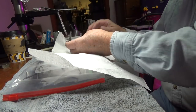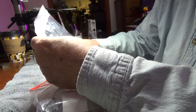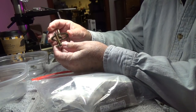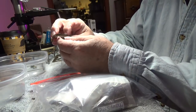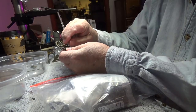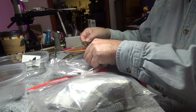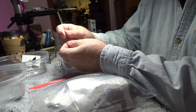Plates. Okay, there's the perch for the cuckoo. This is center wheel. Well, part of the center wheel. This is the minute hand, and this is the hour tube. So that's for time. This is the count wheel that goes on the outside of the movement, and there'll be a little gear that runs this, that goes down near the bottom somewhere. And okay, this is the tension washer, probably intermediate gear. This is the little gear that runs the count wheel.